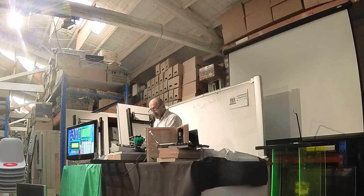I'll do home there. So now we'll press go on the screen here at that location at the program counter 400B. It's saying the B register is 1 and the A register is 0. And if I just keep tapping through, because it's looping through, I can just press the go command. I can see now B is actually increasing and A is also increasing. So it's doing what it's doing, but what's actually happening here, it's going too fast. I need to slow it down. So we've got breakpoints. We can debug that.